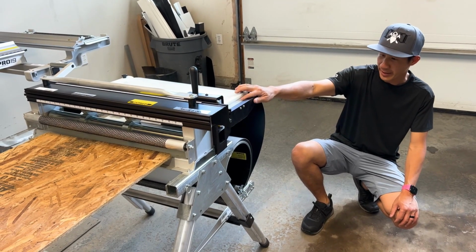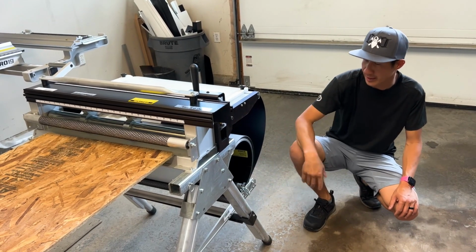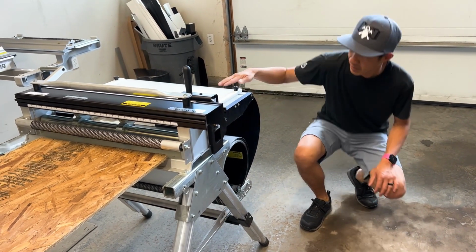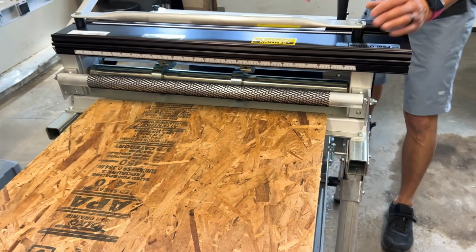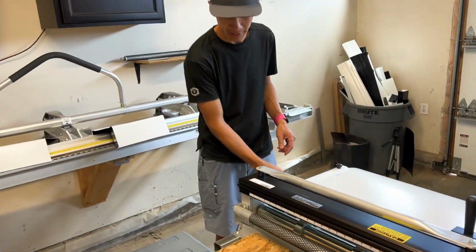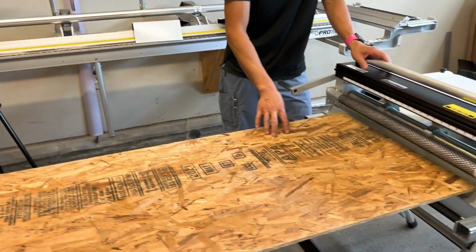Here we've got my brand new Tapco Tools Port-o-Slitter on the adapter stand. What it does is it takes a roll of aluminum, you can feed it through a set of slitters here, and they also have perforators using a hand crank. They have a motorized version too, I only have a hand crank, and when you crank it through, it slits the material into whatever sections you want.